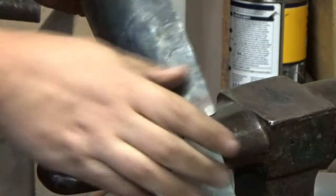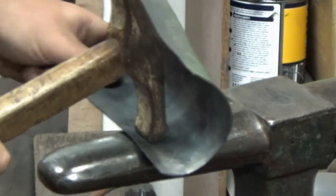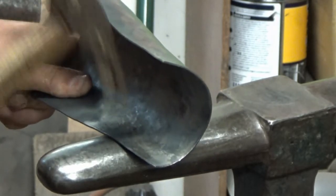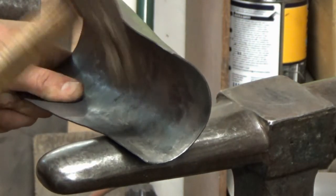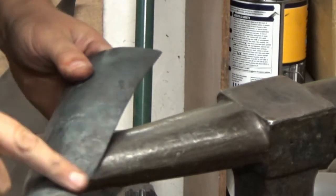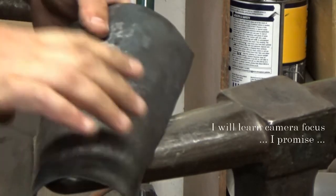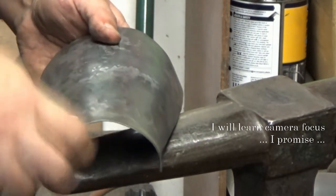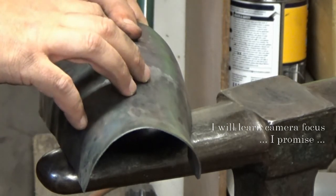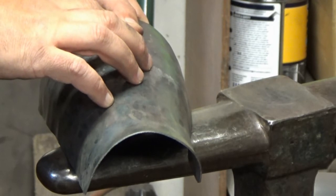Check the material — you can see where it's gone a bit shinier, which is where it's just starting to work down. That's coming out just fine across there. It takes a little time with the hammer because you're making small blows inside, but it smooths them off lovely and lets you keep really good control of complicated shapes. So that's just a quick look at some different ways you can planish. They all take practice and there'll be ones you prefer. There might be other techniques and certainly machines for the process, but those are four quick ways of planishing and getting a job finished.